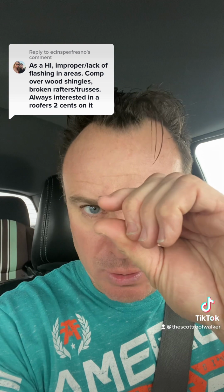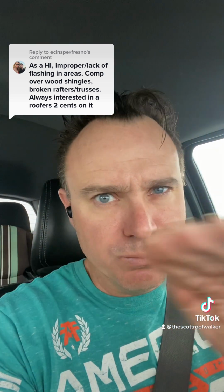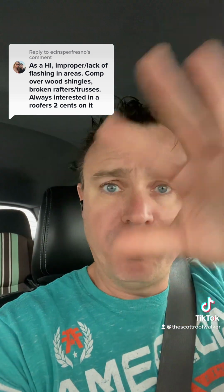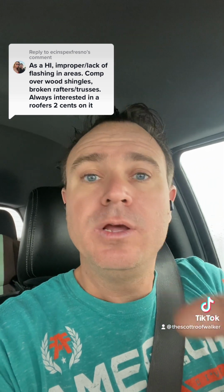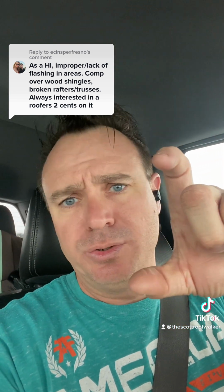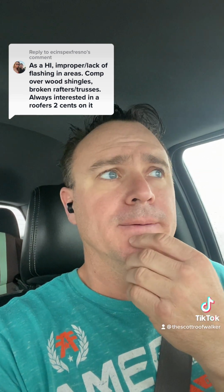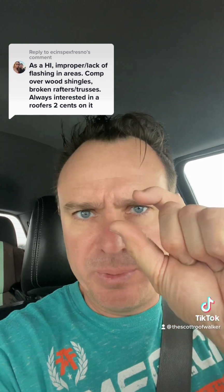Wood shingles are very thin. They're usually a very smooth, beautiful cut. And they have the same kind of breakup and appearance as shakes as far as no pattern, but they'll typically have a shorter exposure. We used to do like 4-inch exposure. Whereas wood shakes look a little more rough hewn. They're typically bigger and a lot thicker.